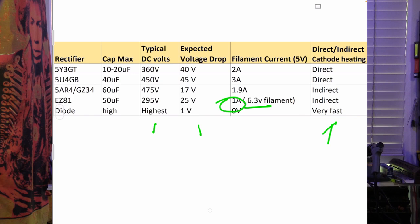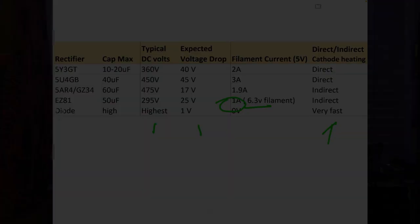Direct heating is where the filament is also the cathode; indirect is where the filament heats up first, then heats the cathode before the rectifier starts doing its job. The diode needs nothing, so it is effectively instant. But do you want rectifier sag? There is a romantic mystery around rectifier sag, but be careful of what you wish for. To have that beautiful bloom of a note that recovers from voltage sag, we pay the price with lost immediacy of the fast note which quickly follows. Sag can cause a loss of punch, but it pays back with that beautiful bloom as the voltage recovers.